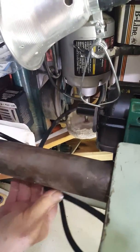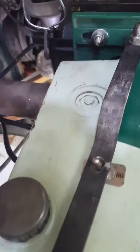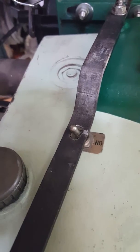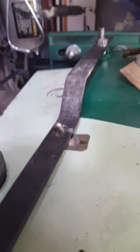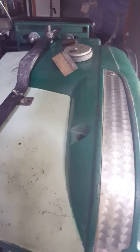A little wiring I had to do — I cut some wire here. It goes up behind in this hollow space right here that I soldered the black wire on, and then the one that goes over to the wall receptacle, I soldered that black wire to the other connection on the switch, and it gives me an on-off. Then I connected the neutral and the grounds together, so there we are.